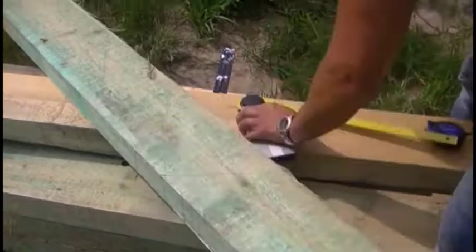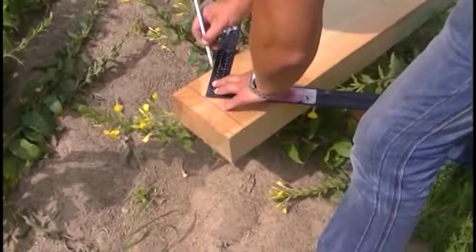This gives us 57 degrees and it is precisely this angle used here for drawing our lock. We also use this angle to mark tile cuts. The same way we cut the second lock, this one will be supported by the purlin.